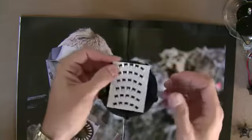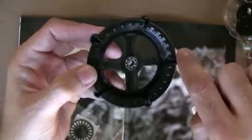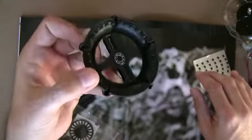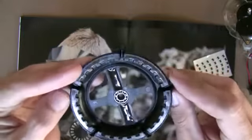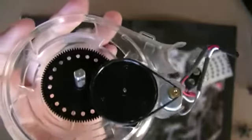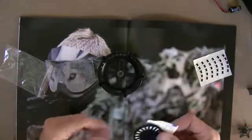Now these encoders will each fit. You peel one off and install it into the inside of the drive carrier. You'll see that every Prophecy actually is already set up to do this. We designed the Prophecy with all of this technology and functionality in mind, so we always knew it was coming. So you can see that the drive carrier is set up to be an encoder. You can also see that we already have a window there in the clear slide for the sensor in the feed neck. So we've always been prepared for this technology. It took us a little bit longer to get right and a little more expense, but we've always been ready for it.